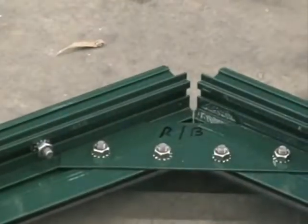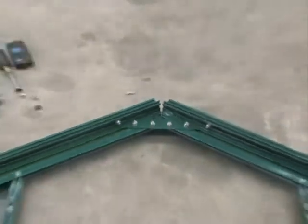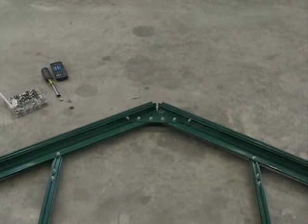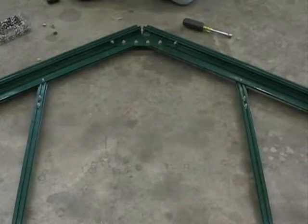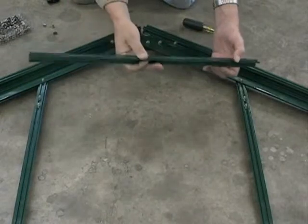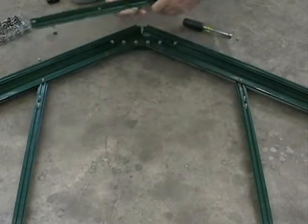Now in the middle again, coming back to there, we're going to do one additional operation here. If you bought the unit with the fan assembly, we're going to put a fan bracket into the top section. The fan brackets that would have come with your kit would be as such. They're a 1 inch, 1/8 angle. They've got 4 holes in them, and you'll install the first one.